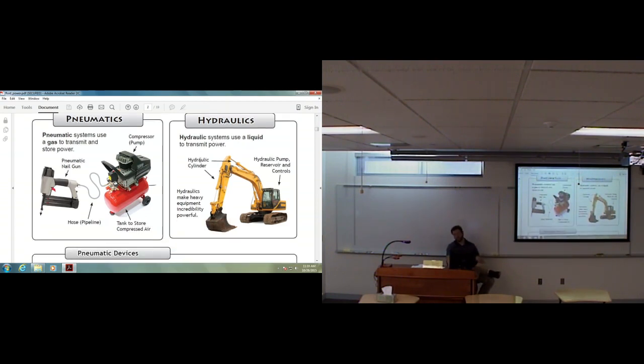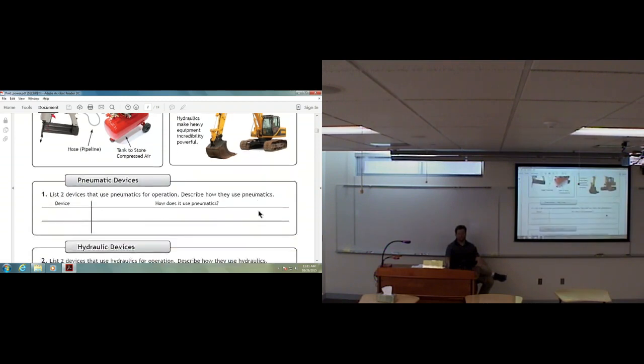And here you can see this big mechanical shovel. Some people call this a backhoe, but it's not really a backhoe. But anyway, it's a big mechanical shovel, and both the arm here, all the parts of the arm, its lifting, its extension, and also the bucket movement itself is all hydraulic. In fact, the turning of it is hydraulic as well. This thing has a huge diesel engine on it that is essentially just creating electricity and creating pressure for this hydraulic machine. The electricity is used all over the machine, including turning the tracks. That's done with electricity. And then they have electric motors on the tracks. Electric motors also create the pressure in the hydraulic fluid to use for digging.